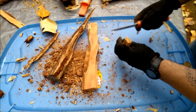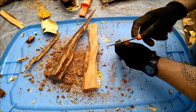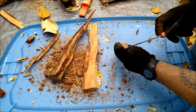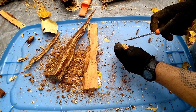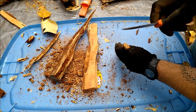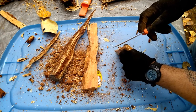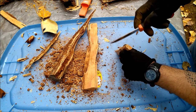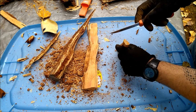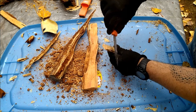It's funny — so the grain. Here's the grain. The rings of the tree are going this direction. There's one there and one there, almost a quarter inch wide. It was a big tree. For a long time there I was carving it with the grain, and what happens is it goes in for a little bit and then it comes right out. It just naturally comes right out — it doesn't split down the whole thing. So it turns out you just try it and find out the hard way: you want to shave it against the grain, and then it shaves real good.